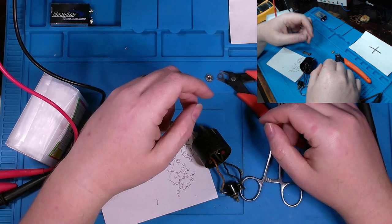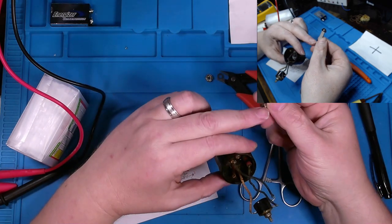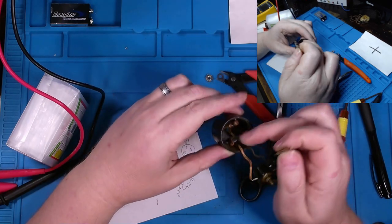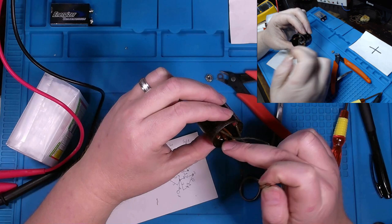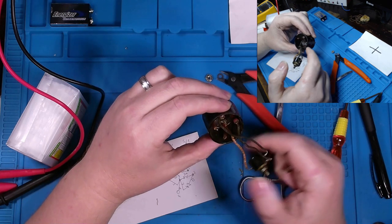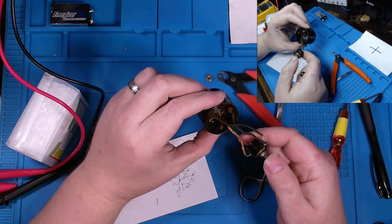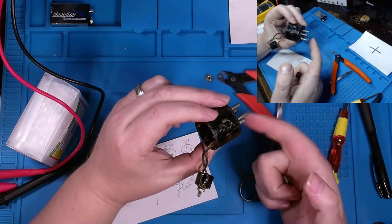Okay, so I've kind of gotten it apart now, and what I actually had to do was snip the legs going to this resistor that's wound and was put here. You had on one side this red wire, on the other side another red wire, but you can see our 2 megohm resistors, the base of which going to these pins here, going to the anode of our selenium diodes, the cathode output going to the bottom pin over here.